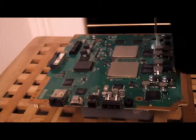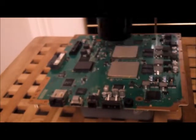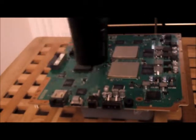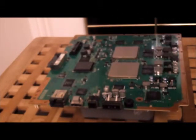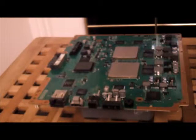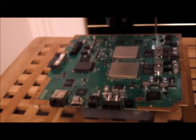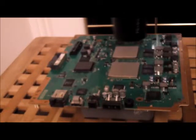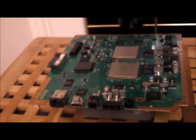Once everything on the board is nice and hot, we're just going to pump the power up. Now the board is all pretty hot, so you really don't want to touch it or move it because you might knock some of the solder out and damage it completely. Now we're going to concentrate on each of the GPUs and the CPU. Go around in a circular motion for 25 to 30 seconds on the first one, and the same 25 to 30 seconds on the second one.